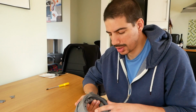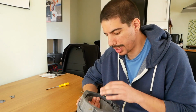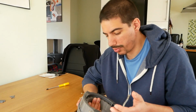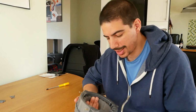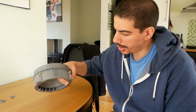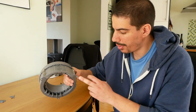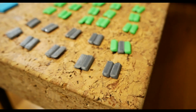There is a bit of friction there and gets clunky sometimes, but for 3D printed parts it's not bad, and with some lubrication it'll get better. So I'm gonna print the remaining parts, assemble it all together, and hopefully be able to do my first test knit. And because 3D parts take so long, I've added these 3 lugs here so that I can actually make some kind of a base for it to keep it off the table. That doesn't take forever to print, so I'll probably do that in the workshop.